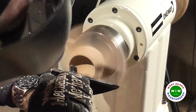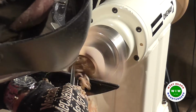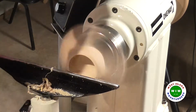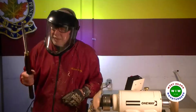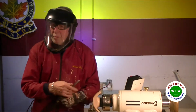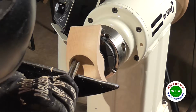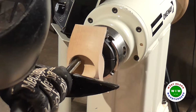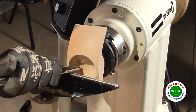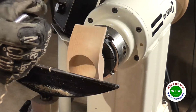How thin do you want to go, lads? You see that clever cut? Fred showed me that one. To keep it such a small hole, keeping on the bevel is really difficult. So, as you're coming in, once you get to the turn at the bottom, you start climbing. So now you're on the bevel at the bottom of the gouge. You swing that across, and then just lift the butt up, and you can go. You've never come off the bevel, because as we all know, if you come off the bevel, it's a hell of a mess.